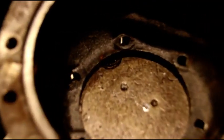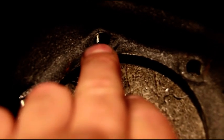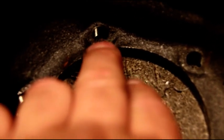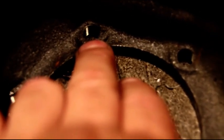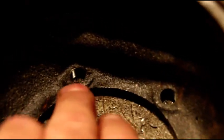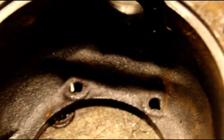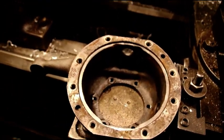Okay, here's the inside of the knuckle and you can see the threaded area. It's just raw casting — it's not flat. There's no sense in putting a stud in here because you still only have about three hundred thousandths of thread engagement. So we need to make room in here for the bolt that I'm going to use — that needs to be machined. These need to be flat. And there are a couple different ways to do that.